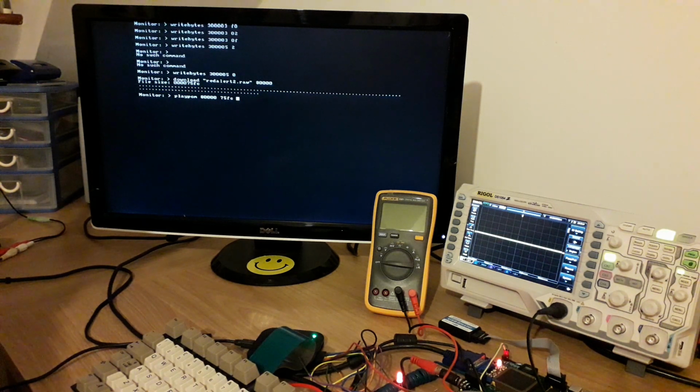Well, actually, it doesn't. It translates each byte into a word, because the SPI format is word-based, 16 bits: 4 bits of control data, and then 8, 10 or 12 bits of DAC data, depending on which model part you're using. So I'm using the 8-bit version, sorry, so the low nibble isn't used.